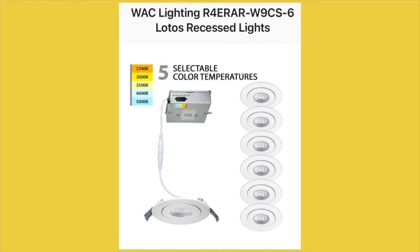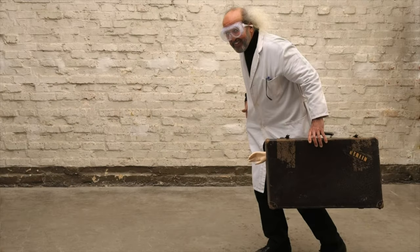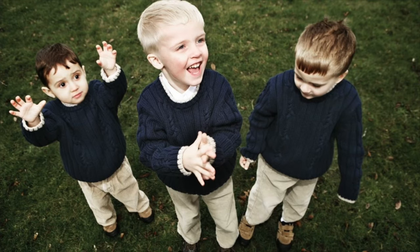The other big concern with wafer lights is that once the bulb dies, the whole fixture is no good — it has to be replaced. Then there's the concern of whether it will match the other lights that haven't yet died. With a recessed can, you just swap the bulb; the fixture stays the same. With wafer lights, once it starts to die, it dims slowly until there is no more. Once it's dead, you cannot bring it back — no new bulb. You take the whole fixture out and start over. The concern is that a replacement fixture won't match what you have. You could buy extras and stash them away, but whether it matches the other fixtures or you have to replace everything at once remains to be seen.